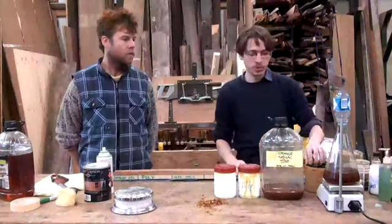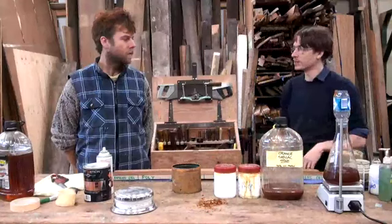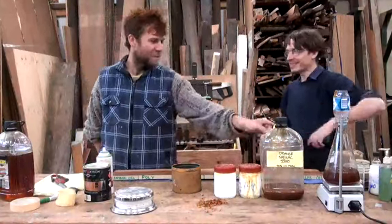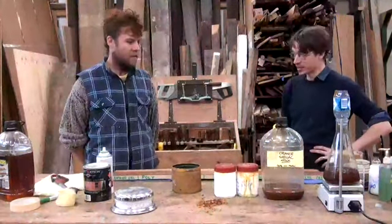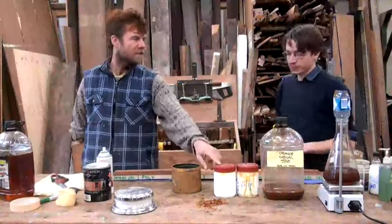Sure. Which is your more French polishing mixture. 50-50. Yeah, 50-50. I'm just trying to think of the ratio. Then that ratio ends up being... becomes, so what was that? 1 to 4? Then it becomes like 1 to 8. Yeah. And then what was that one? And then that one ends up being like 1 to 14 or 1 to 16 sort of ratio. And that's what you polish with. 1 to 16. That's what you polish with. Maybe that's what I'm being told.